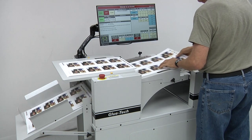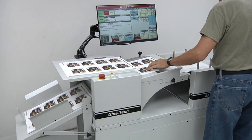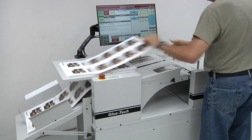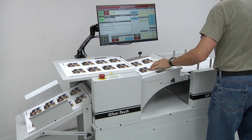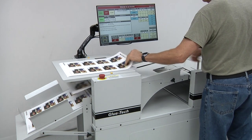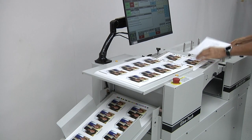The vacuum conveyor advances the bottom sheet to the head stop. When sensors confirm the aligned position of the top and bottom sheets, a pinch roller grips and advances the sheets through a pair of adjustable squeeze rollers. Glued sheets are then ejected into a delivery tray.